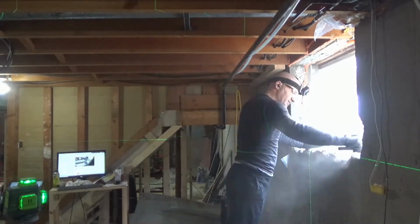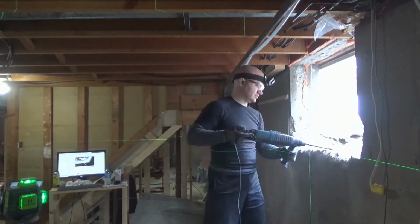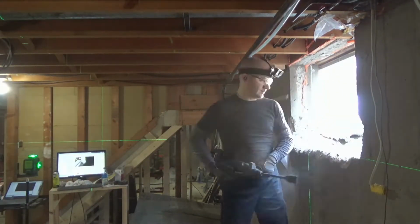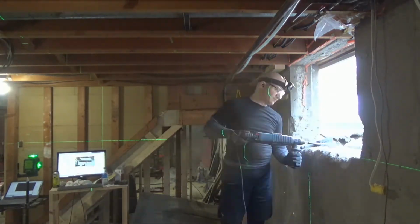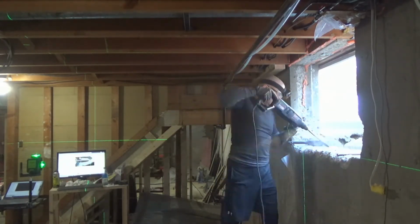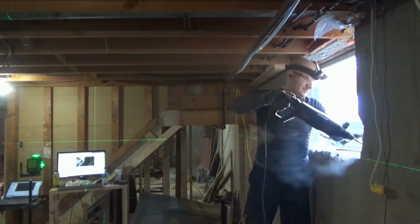We also have to look at what this job cost me to do. I bought a single 3/4 inch drill bit for about $60. I already had the rotary hammer. I now have to buy grease for the rotary hammer, and that will probably cost me about $10. I also bought the windows for about $200 each. One can of spray foam, some shims, and some leftover flashing tape brought my total to 2 days' time and about $500. The windows stay with the house, and I get to keep the bit.